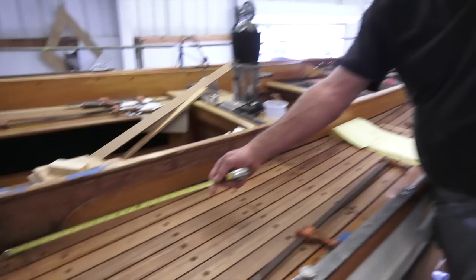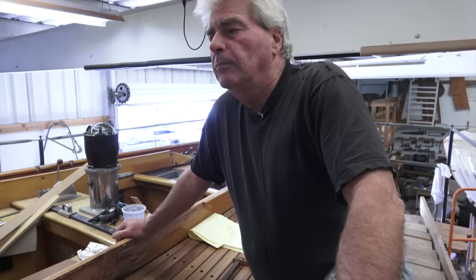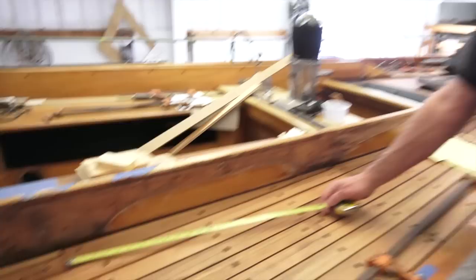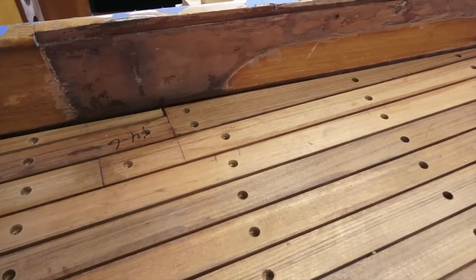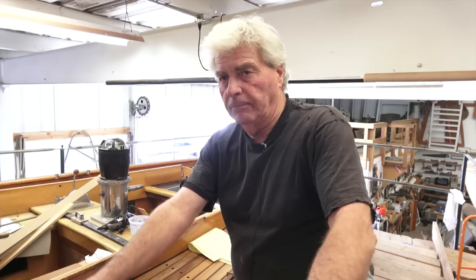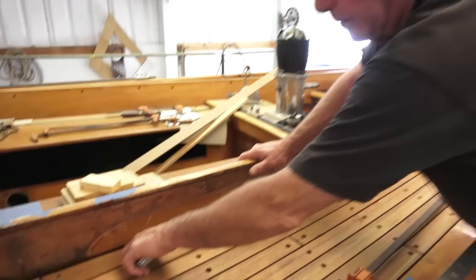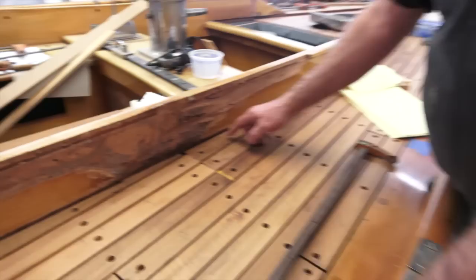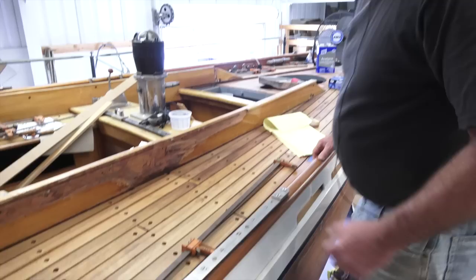Yeah. So because of our limited plank lengths, which was 14-7, I think, the longest one, you can see here where this one ends up under the winch pad. This course is only 2 planks long. Oh, that whole one, huh? The 14-6 and the 9 up there. So you try to use your materials to advantage. And if you got winch pads and the deck's already this thick right there, remember we put all that blocking in to take the bolts for the winch pads? So that took care of that. See this plank here would have ended up in a little feather right here. This one would have ended up in a feather here and here. So we kept it down to just 1 feather per side on the boat, which is fine. Just the thing I'm hung up on.